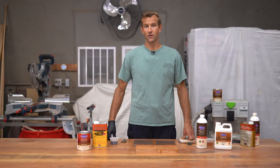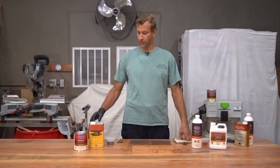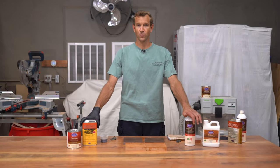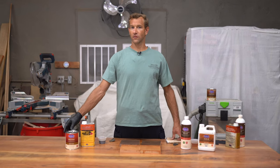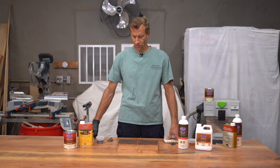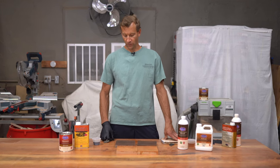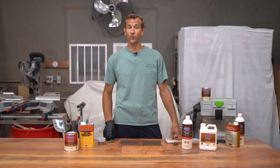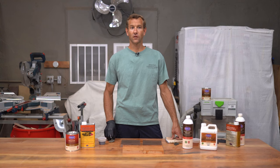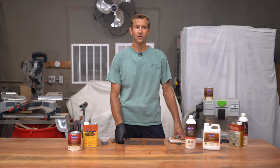These are really great products we've used for years and been impressed with how well they hold up. What's nice is they're scalable — whether you want one or two coats, or three coats of sealer finish followed by two to three coats of satin, semi-gloss, or high gloss, you can achieve a truly waterproof surface with different looks and sheens. There's really no right or wrong way within reason, as long as it achieves a good finish. Thanks for watching — feel free to leave questions or comments and subscribe to the channel for more videos.